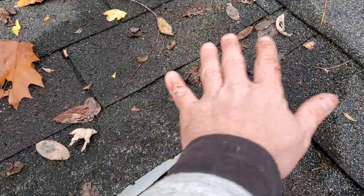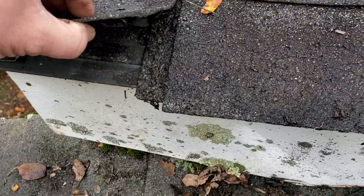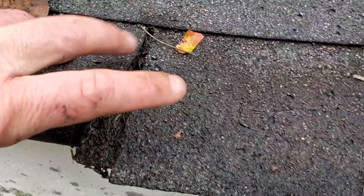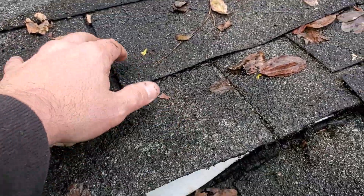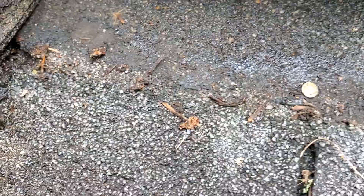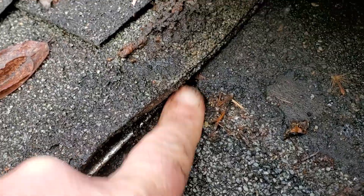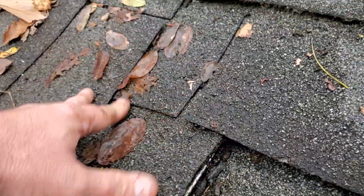We've got a really concave section of roof right here. If you lift these two shingles up, the roof is right there, so water can easily get underneath that section. This section here is completely flat. Lift that up — you can see there's a completely rusted out nail right there, it's soaking wet underneath. There's another rusted out nail right there. Lift this one up and you can see there's actually a hole right here going down into the roof. That's probably where most of the water is coming from.